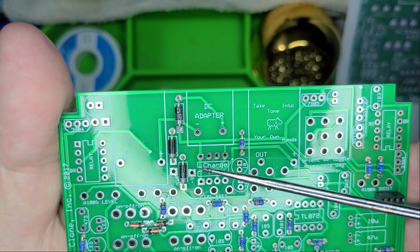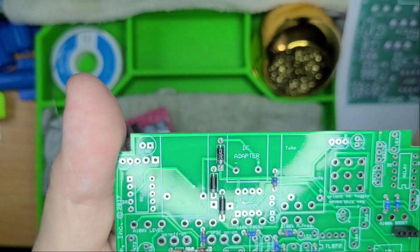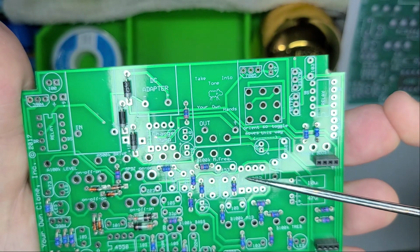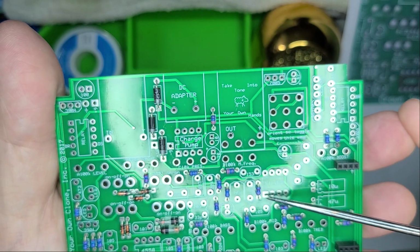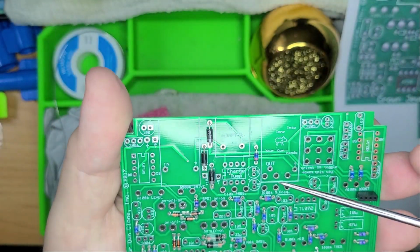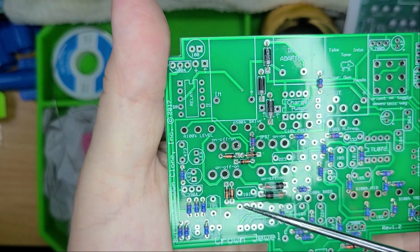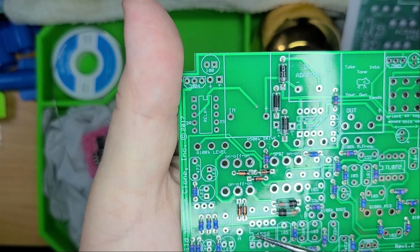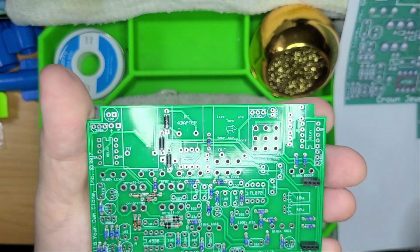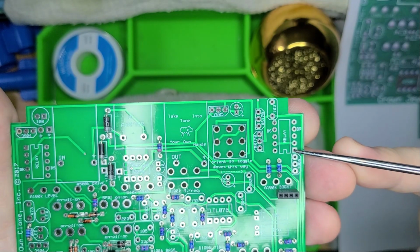Yep, charge pump. You can see the circle, or the little cutout right here, which means the circle will go here. The TL072, you can see it right there. Notch there. 1 has the square. You kind of get a point as 4558, notch, square. So top and 1. Once you do it a few times, it's pretty easy to remember, but you can even see on the relays, you'll see the notch here and the 1 here.